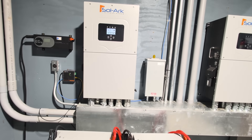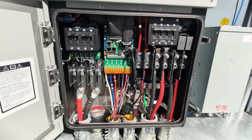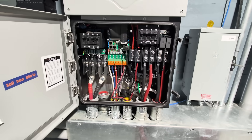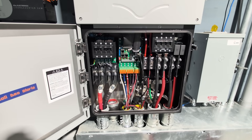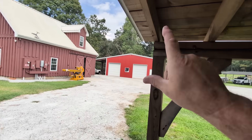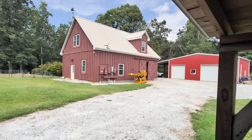What don't I like about it? I was hoping they'd give me four MPPTs, but they stayed with three — going to four apparently would have cost significantly more. Before I forget: this inverter is going to be around $7,300 MSRP from what I've been told, though that might change after the show. There's been a move to take features out of an inverter and move them to a separate device attached to your home, but what if you want to load-shed loads in a building 150 feet away and another 70 feet away? You'd seemingly need to put a MID on each building.